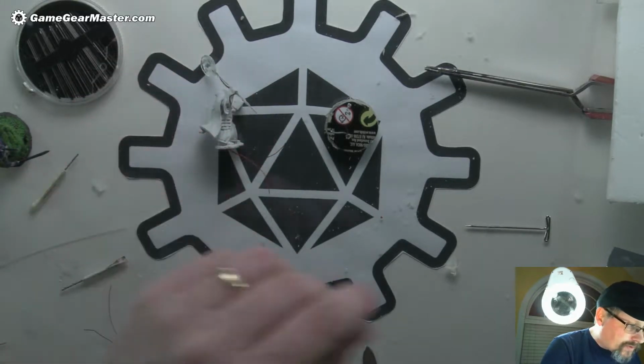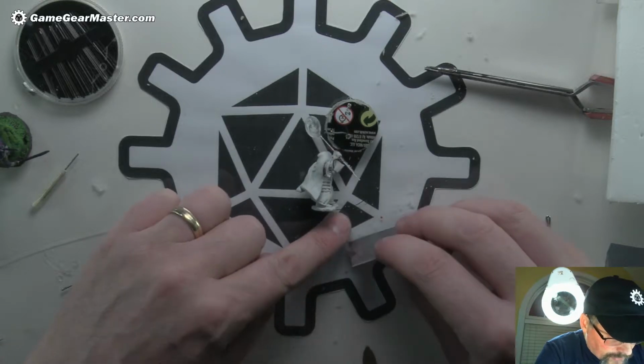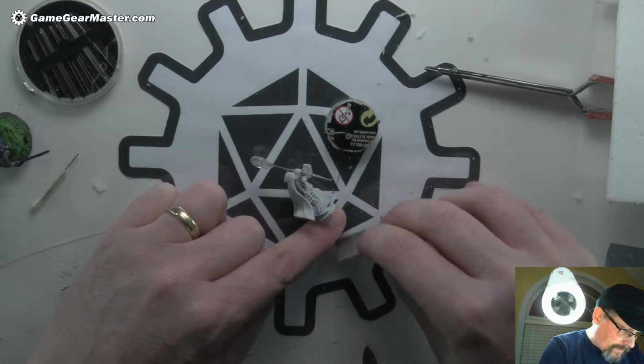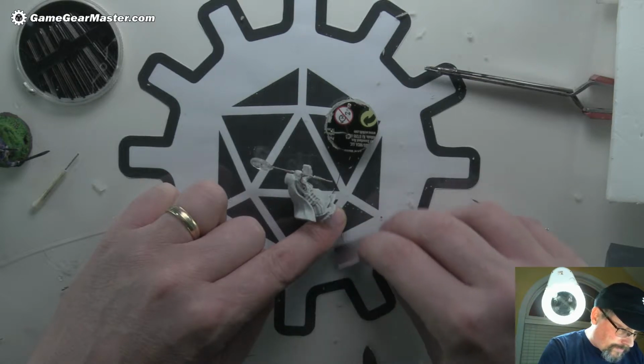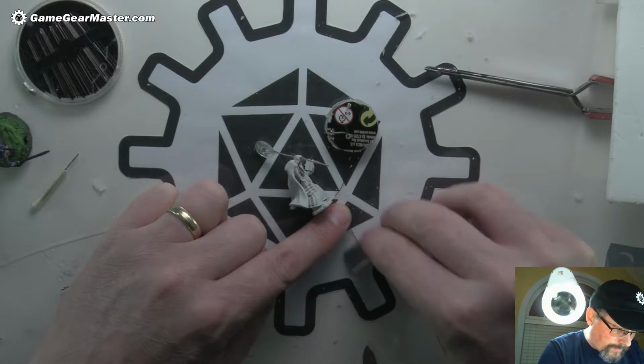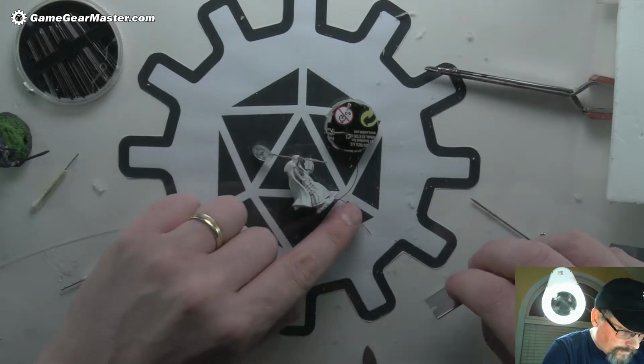Okay, so then it's time to see if we can scrape off the insulation here. You can do this with your utility knife too. I just happen to not know where it is right now. And I'm just going to scrape this off. Start to see copper, then roll it over and do it again. Roll it over, do it again.